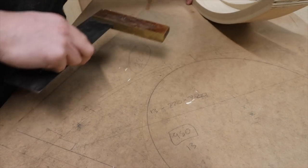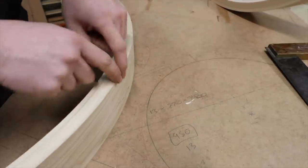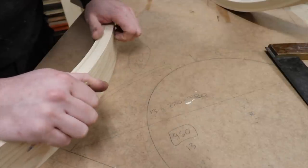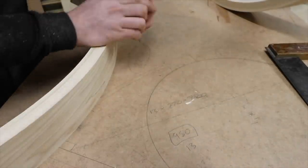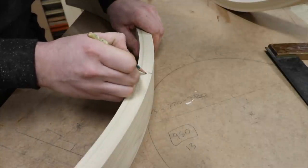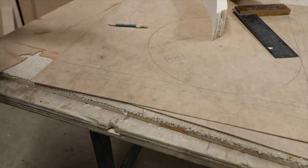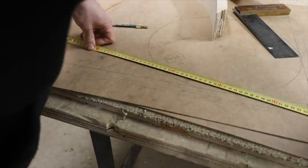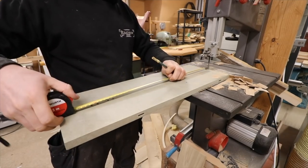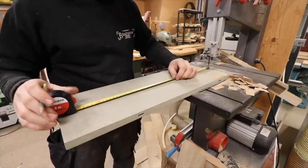Right, so let's make a little sled to hold them in. Again, much as I did last time, I'm looking to cut a sled that fits the outside of this curve. So it's going to be using the bandsaw turntable again, like I did in the frame with the egg, working from the pivot to the outside of the bandsaw cuts, so the material left is the same radius as that point there on the outside of these rails. So I can take that measurement off of my drawing. It is 601 mil from 100 mil, so that's 501 mil on this side of the blade to my pivot hole.